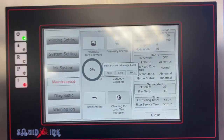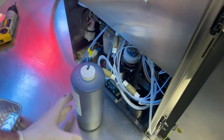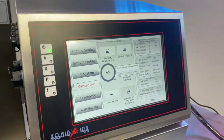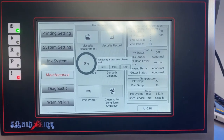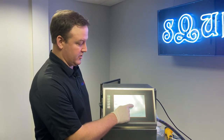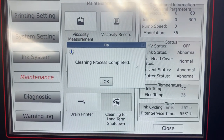Our second cleaning process is complete. We'll see a familiar pop-up: 'Please connect drainage bottle.' We're draining the printer out one last time and then our cleaning process is complete. Hook up the drainage bottle again, put the drain pipe in, pump the system out. Same as the previous two draining sequences — let it go to 100% or visually monitor the drain line. When you're just pushing air, click stop. Our final drain is complete. Click continue and you'll see on the display: 'Cleaning process completed.' We are all done flushing the Jetstream out.